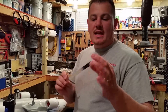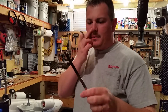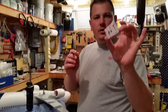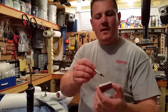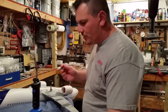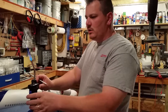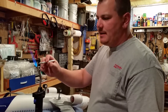These shims are really nice if you happen to stumble onto them. I get these at work — I work on industrial scales, so I have piles of them. What I did to keep the blade control: you can see how it's all wonky when it's very first hot. You dip it in and it'll make a more consistent blade temperature and then I can go through the cut. I've just got a little conventional torch, nothing special. Turn it to a low setting and basically heat up the tip.